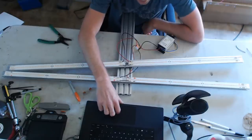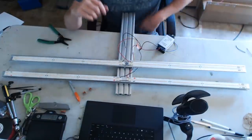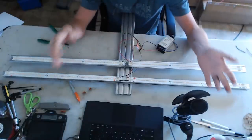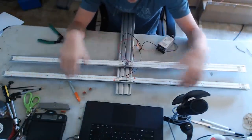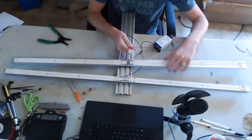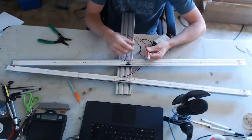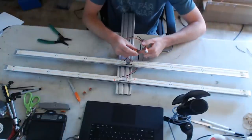Looking at the chat — about 117 people, happy Memorial Day! Just a quick example of how to do a series-parallel configuration or set up a 54-volt strip. All we're doing is connecting all the positives to the driver's positive, and the two negatives to the driver's negative. It gets split by however many we connect.